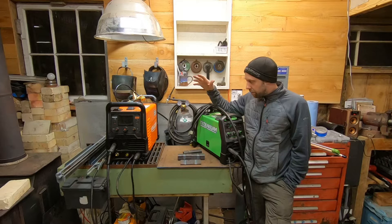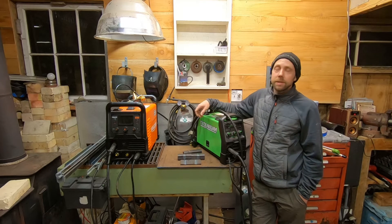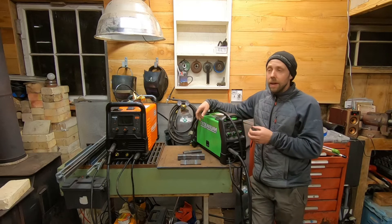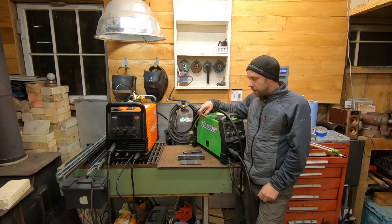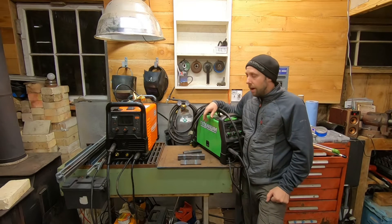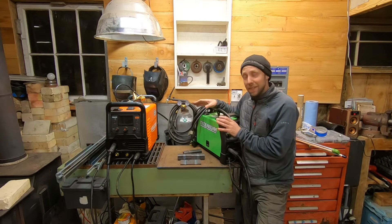I felt like I've done pretty well so far just learning it and I'll just get better from this point. The big change for me was buying those Pyrex cups. I've been playing around with this stuff off and on and all the welds always looked kind of crappy — grayish looking, no matter what gas setting I had. And the tips constantly got contaminated with tungsten. After getting those cups it was a big difference. I think what was happening was bad gas coverage causing the metal to bubble and fling stuff onto the tungsten. I contaminate the tips far less now — almost not at all. In this video there's no tungsten contaminated.